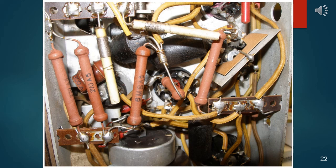From the late 1920s, German manufacturers were making high-value film resistors applied on ceramic tubes by a spray process or deposition of a carbon-rich gas, such as propane, in a high-temperature retort. Afterwards, end caps were applied, and then some versions had a spiral groove cut through the film to raise the film resistance to the desired value. A protective coating was then applied, resulting in a very stable, high-value resistor.